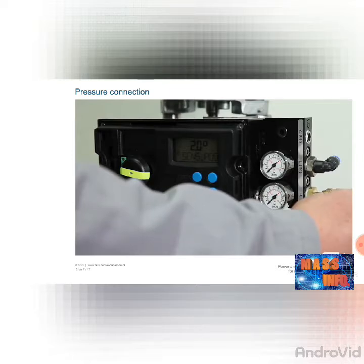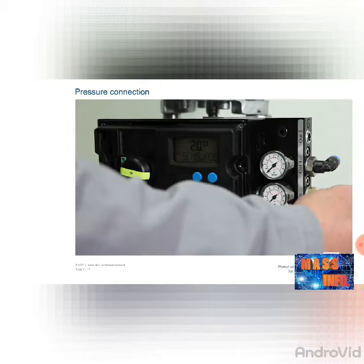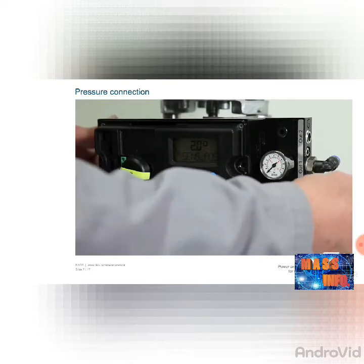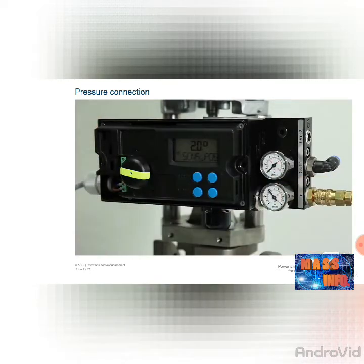For the TZIDC, the pressure must be between 1.4 bar and 6 bar, and for the EDP-300, between 1.4 bar and 10 bar. Contamination in the air pipe and the positioner can damage components. Therefore, blow any dust, chips, or other dirt particles out before making any connections. Connect the compressed air connection lead to the supply air connection.